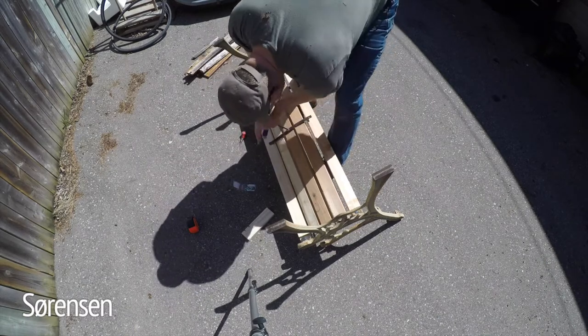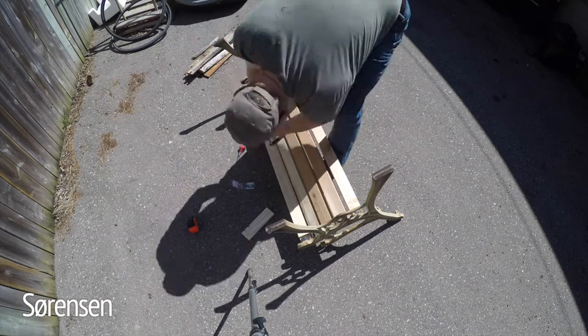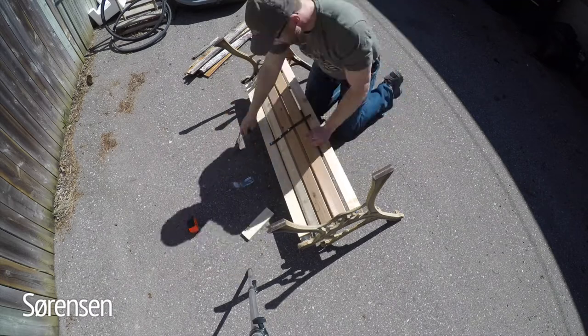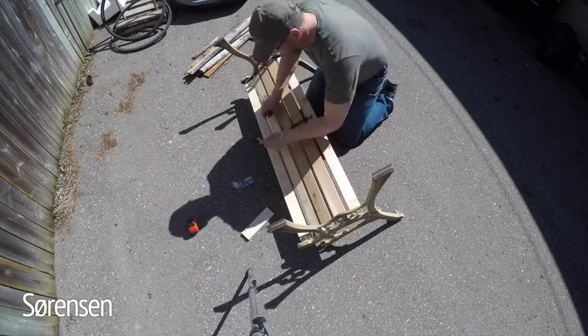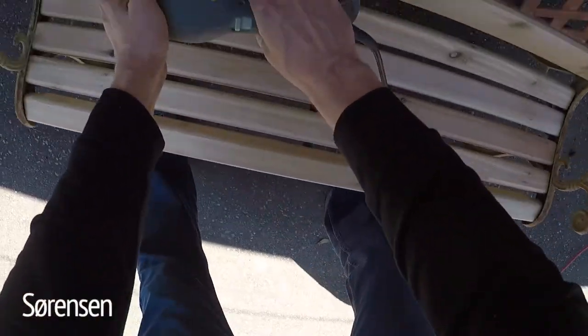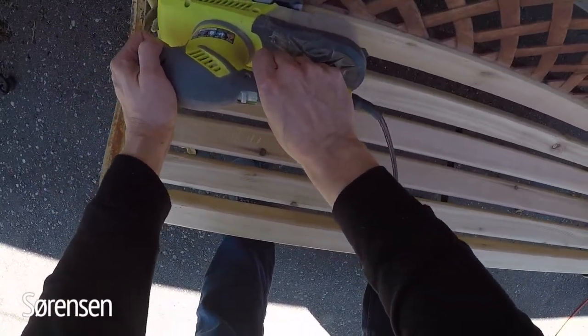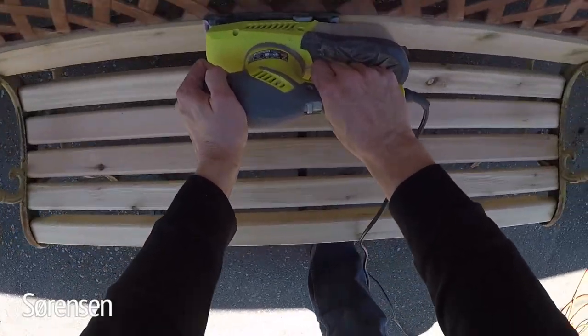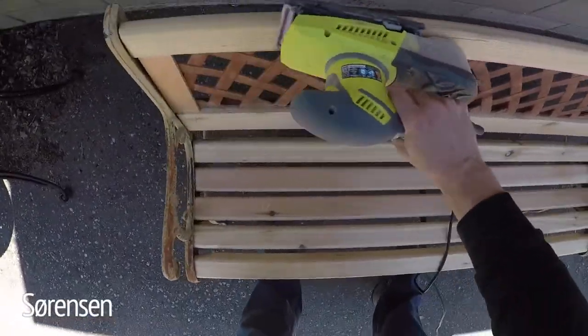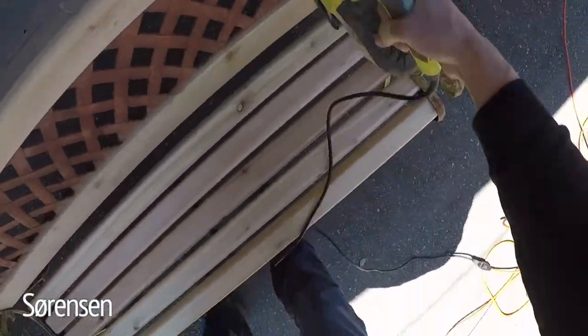It didn't take long to mount all the seat pieces into the cast iron using shallow flathead screws, and my dog Echo came to help me with this part of the operation as well. I move on to using the little centerpiece and mount that in with the same flathead screws. Once all the cedar is mounted into the cast iron and the bench is in one piece, I begin sanding it — starting with 120 grit sandpaper, then graduating to 180 grit, and eventually finishing with 220 grit to get that nice smooth cedar feel.